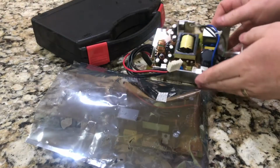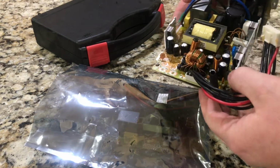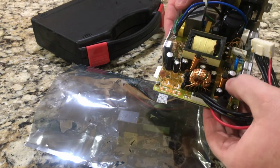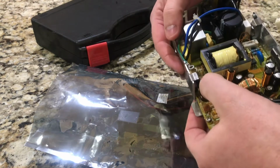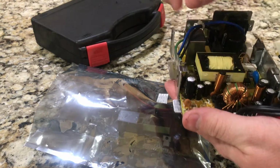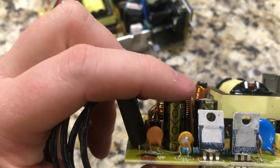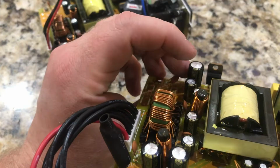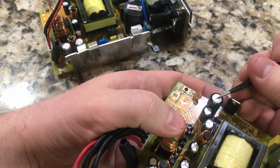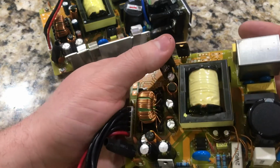This right here is my old power supply, and one or many of those circuits are no good. I talked to a friend, and he said that a lot of times these capacitors will have a breaking point where they start flat, but then they have these like perforated tops. And if one of those or a couple of those are sticking out, that's an indicator that it has swollen on the inside. And I think it was the 80s, they started making them so that they would bubble out like this instead of explode. So I'd prefer this than exploding.